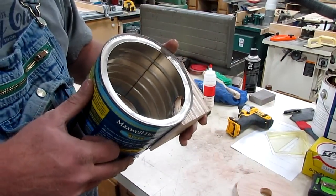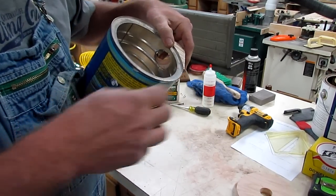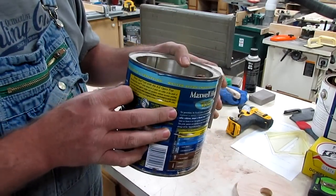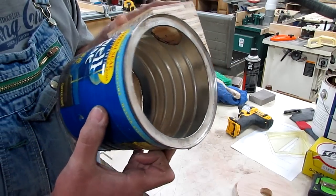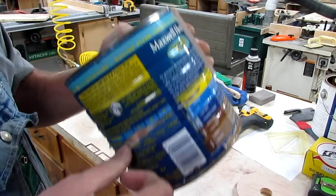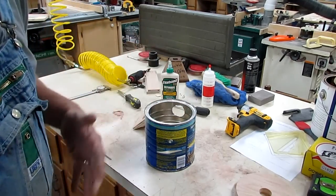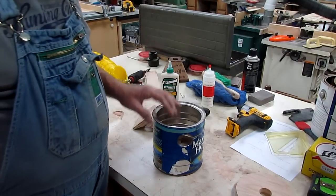We'll take some caulking and put around that thing, and then I'm going to bore a couple holes through the can. I'll pick out a couple of locations. So after I've got those holes bored in it and I caulk up around there to make sure that we have a really good seal on the can, then I'll put some screws in it and hold it up there. That'll hold it to the can. The silicone will dry up and you'll have a good tight seal around it there.